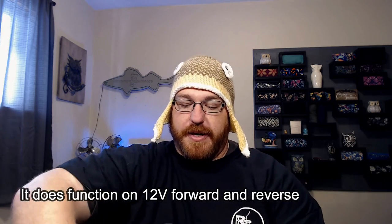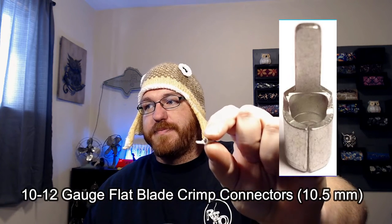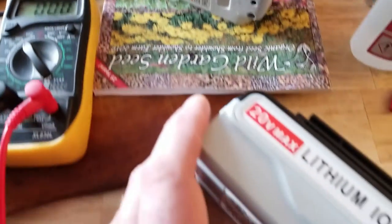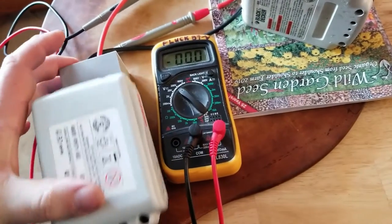What I have done is I went ahead and got another piece for this project — I think they're called straight or slotted terminal connectors. The really cool part about these is that they fit right into the slot of that battery and butt up to the back. It's real nice — we can 3D print an enclosure where this will just snap in straight on top. I ended up modeling this up already; it's just a prototype, a proof of concept, and it seems to work well. It mounts with two quarter-20 bolts but it's open to interpretation.